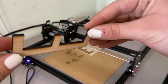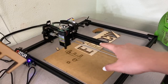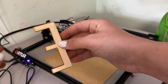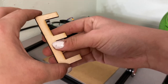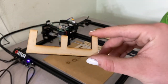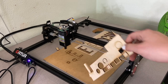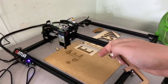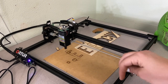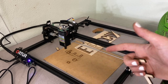You can see how perfect this just cut. If you wanted a better look, I'd say elevate your piece of wood and do a reverse cut so the bottom would actually be a clean look. For me the burn marks don't really matter. This is just a phenomenal cut, and always remember to give your machine a test cut before doing your final actual product. Now I'm going to go through and do a bunch of different tests to see how low this laser percentage can go and still successfully cut a piece of wood.